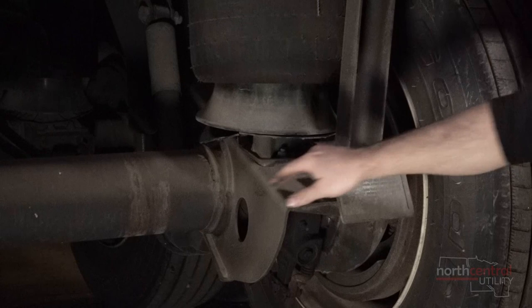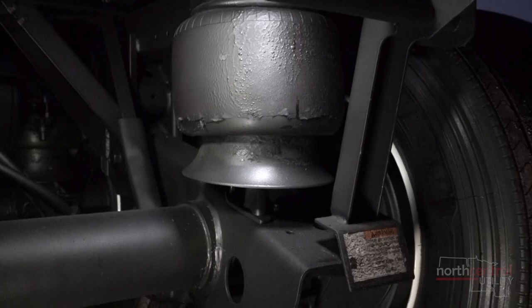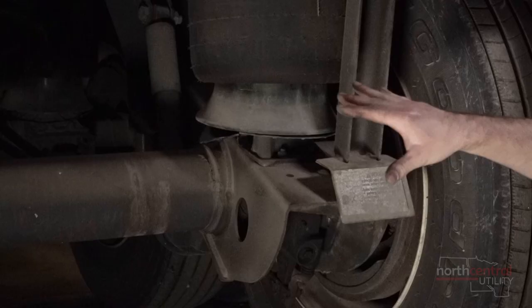How it prevents the trailer from walking away: you have the dock lock arm, the suspension arm, and another airbag up in the front corner. When the trailer is parked, these arms sit in place as they are right now. As the trailer is being loaded, the suspension will squat and these arms will rest on the suspension arm, limiting the travel of the suspension.